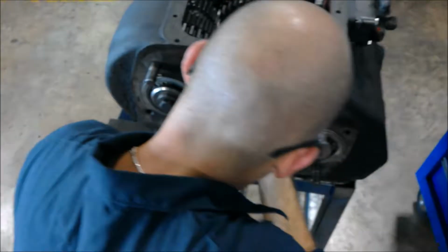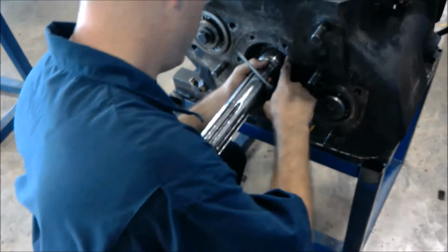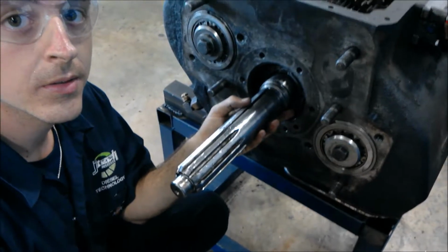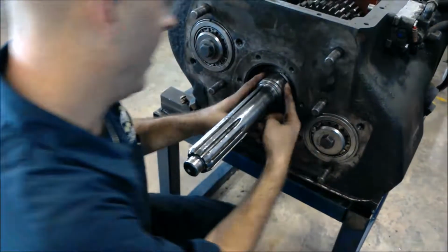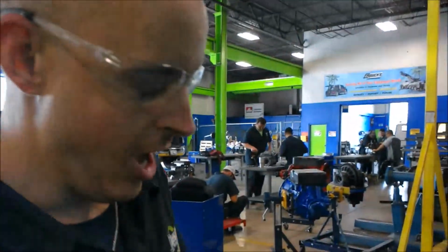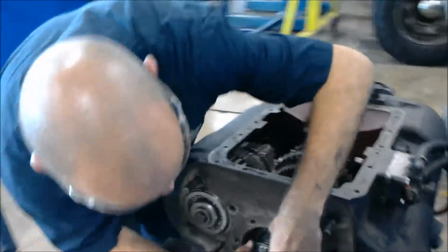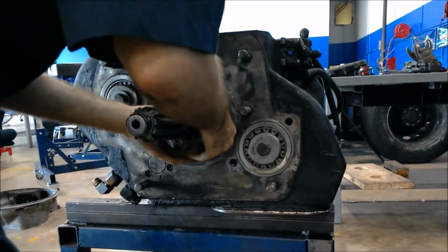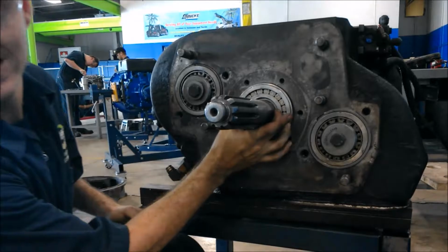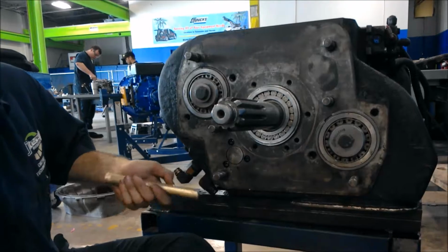Alright, stop. Pull it out. Okay. Pressure down, lock the bearing in place. Tap. Alright, proceed again, take it out, wiggle it, take it out, put that pin a little bit, get the pressure, tap down, see it bend, that's what we're looking for. Bearing pops off.